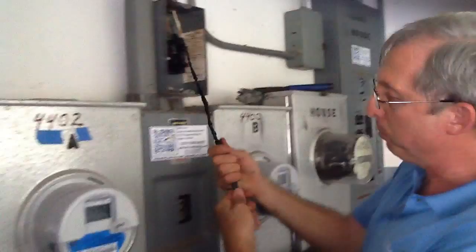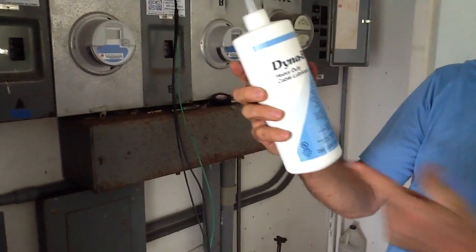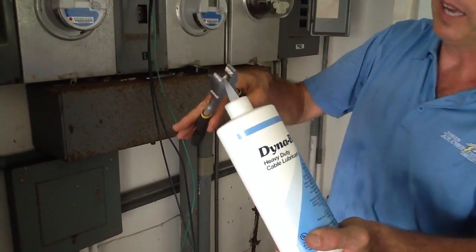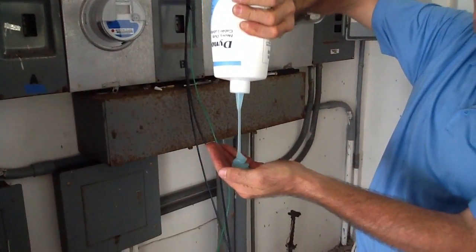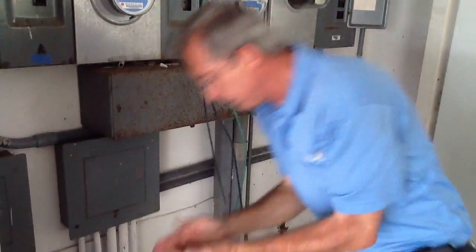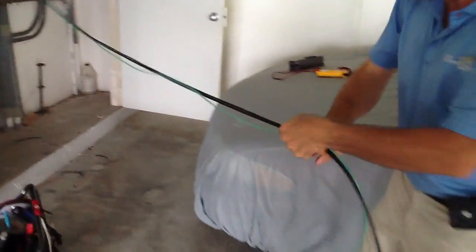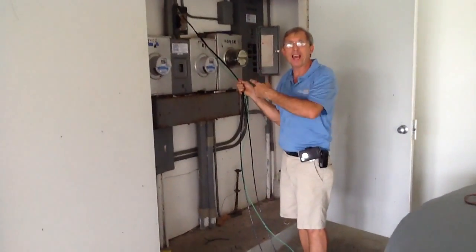I don't have anyone to show us pulling the wire, but I'm going to show you something we're going to use called wire lubricant. Any time you pull wires through a conduit — and we're doing it the hard way, pushing it up because of how it has to be on the other end — I'm going to grease this thing down with wire lube as my technician pulls from the other end. This stuff is nothing but soap; you can actually wash your hands with it. Be generous, don't be shy. Go ahead and run it down about 10 or 15 feet. As he pulls the wire, I'll probably add more.